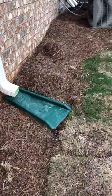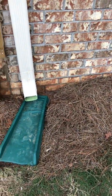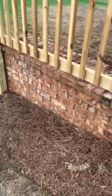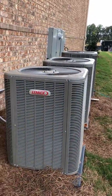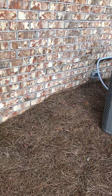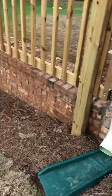And what's worse is, I do not believe the French drain is corrected or connected correctly, because when they initially built this house and installed the French drain, it ended at the end of the house. Then it was decided that you guys needed to build this extra retaining wall. So there's no area in the beginning of the French drain, which supposedly is way at the front of the house, to actually allow water into the French drain. And so none of this area here is properly venting or getting rid of the water, especially as it pertains to over here.